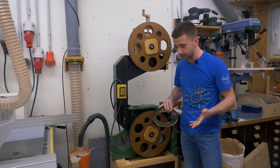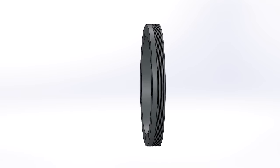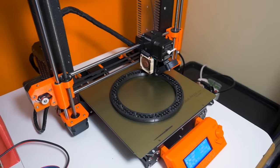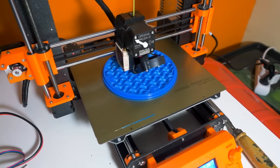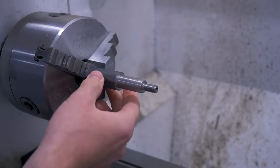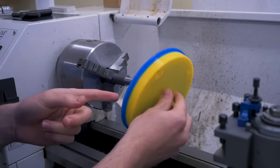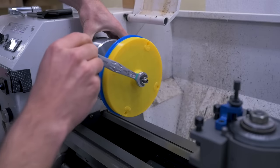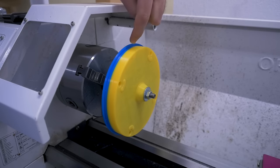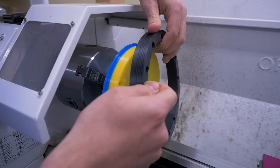With the bearings now done I can start working on what I actually want to do, and I'm starting with making a new pulley for the drive wheel. Since I want to 3D print the pulley, I first had to make the 3D model of it and I made it a bit oversized so I can turn the final shape on the lathe. I also printed a jig to hold the pulley on the lathe. We already have a shaft that was used for a different task — it has a turned part, threads at the end, and a centered hole for a live center.